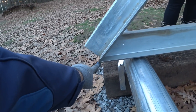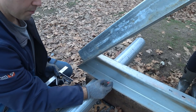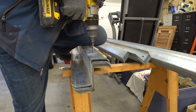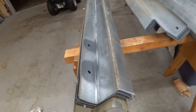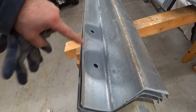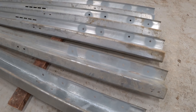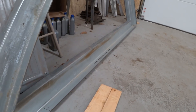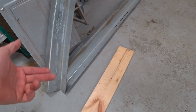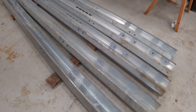Here's my rough idea — I just want this front lip to be lined up with the front of that timber, with the bolt holes out near the edge of the pipe. All my pieces are done. I have the holes drilled and I sprayed some galvanized coating on there. I wound up having to drill two sets of holes because my first set was in the wrong position. On the mock-up you can see it has to go a certain way because all the other pieces need to lap on it in the same direction. So when I drilled the holes I had it flipped the other way and there was no good way — I wound up just drilling a new set of holes to get them all to line up properly. And they're all sprayed.